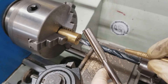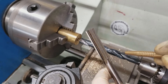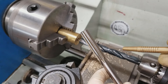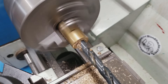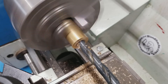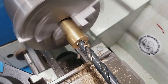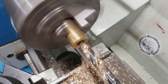I've got my larger drill chucked up now — it's really just a preparation step. You want to choose a final drill size that's a bit smaller than the reamer you'll be using. You might go a 64th under in imperial measurements, or in metric, about 0.5 millimeters under your final reamer size. Now with the larger drill, I've slowed the lathe down again — this time maybe 400 RPM. And there's our final depth right there, so loosen the tailstock and slide that out.